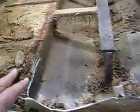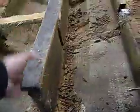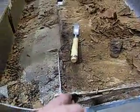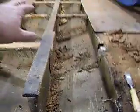They would have put all that structural stuff in, and then they actually had an assembly with the two stringers. You had one board that ran this way, another plank that ran this way, or board, whatever you want to call it, that ran this way in the keel, and then we're calling these stringers because in an inboard, that's what they call them, engine stringers, that's what they lay in on. But anyway, and another one here, and they had these cross members. Well, this one we've cut out, but they had these cross members across, which are white oak. All right, and then they would set that down in the hull.